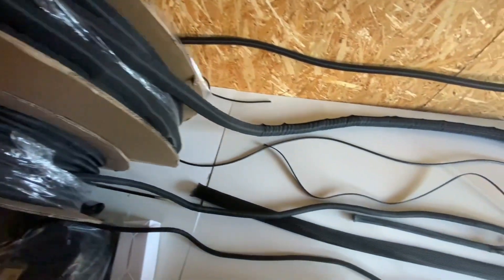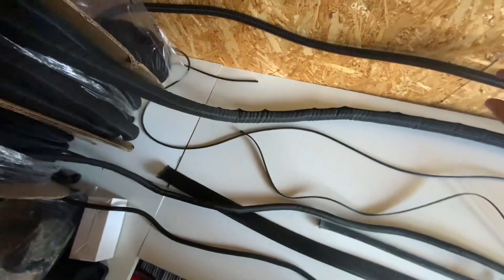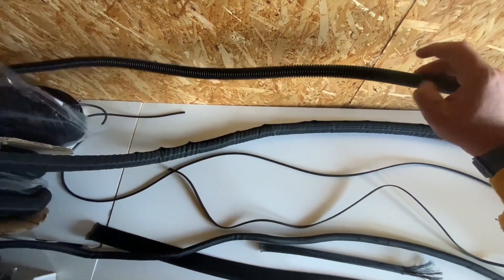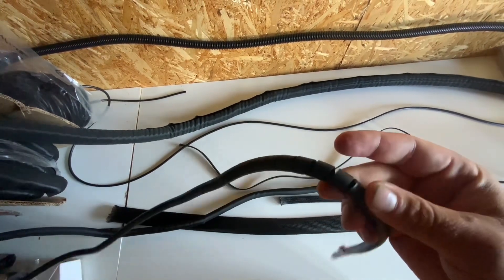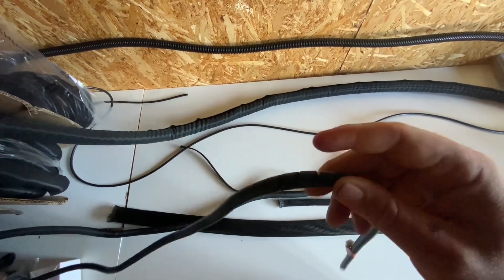We went out and purchased the relevant crimping tools. So we've got it all laid out on the board, wires on, connectors fitted, used a huge number of cable ties — probably not very eco-friendly but it was the simplest way to keep things organized while making the loom. Then to tidy it up we've got some braided sheaths that go over the wires. For housing the loom within the vehicle there are a number of options — we started with hard plastic stuff but it's really not the best. We've used spiral binding which wraps around nicely and can be applied after the loom is in the vehicle.